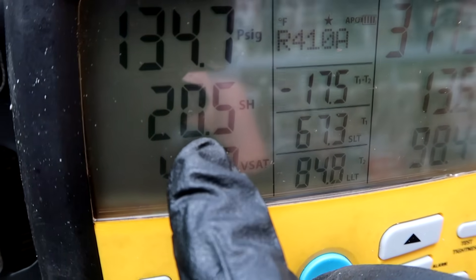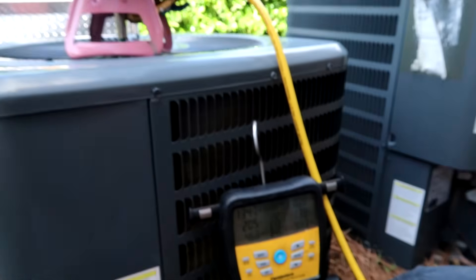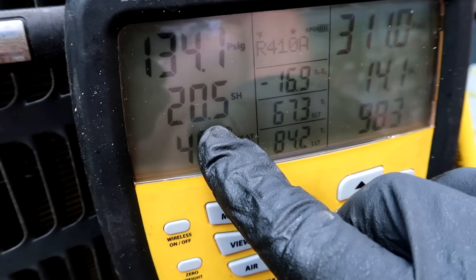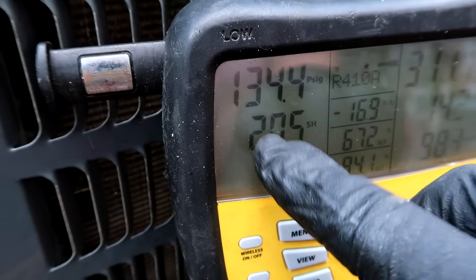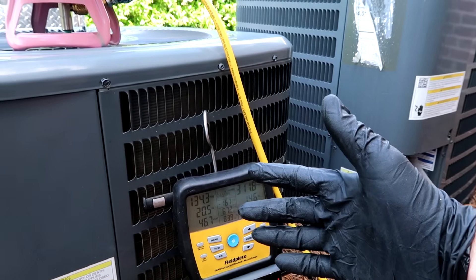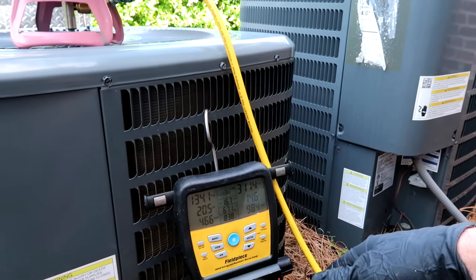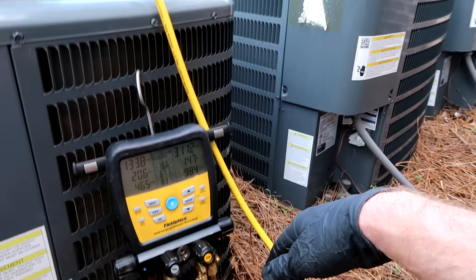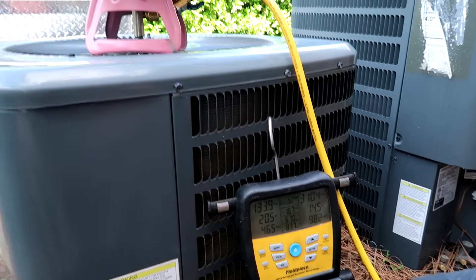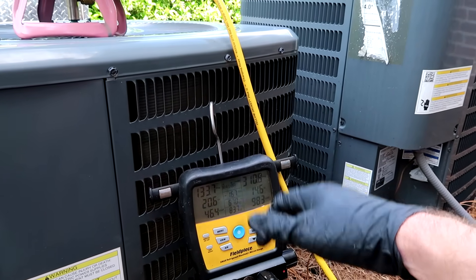Got the subcool bouncing between 12 and 13, but I cannot get that superheat below 20. This is a rotary compressor again — totally different unit, but that's a little better than the last one which was around 28 superheat. These rotary compressors — I cannot get that superheat below 20. What's up with that? What do you guys think in the comments? All bad TXVs? Just like the whole property is bad TXVs? The guy's chief-ing a blunt so I can't take my leak detector up there with the camera, but pretty sure it's going to be a bad coil. Thank you guys for watching, see you in the next one.